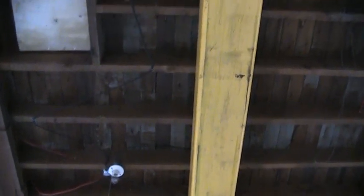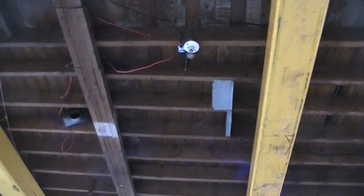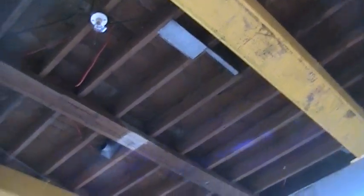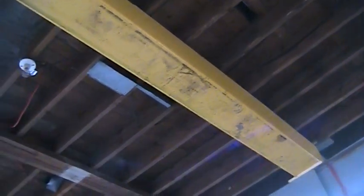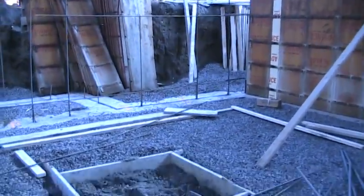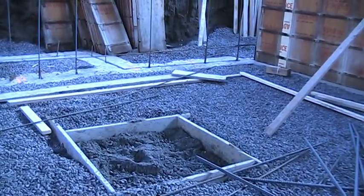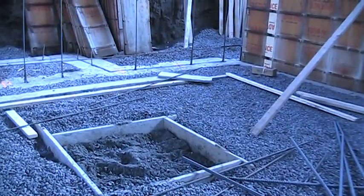One of the reasons why the beams are so large is that they're spaced about 10 feet apart, but the corridor is four feet wide running through the center of the house. The walls aren't exactly load-bearing walls, but they can be reinforced to become load-bearing. This means the load will be off-center relative to the beam, which applies a torsional force. So when you do the calculation taking into account shear, moment, torsion, and potential future loads, you need these huge beams. The load on the column, once you calculate live and dead loads with a safety factor applied, you end up with 44,000 pounds. That's the load on the column. The column will also be parallel strand lumber, five and a half by seven inches, resting on these footings that I'm not too happy with.